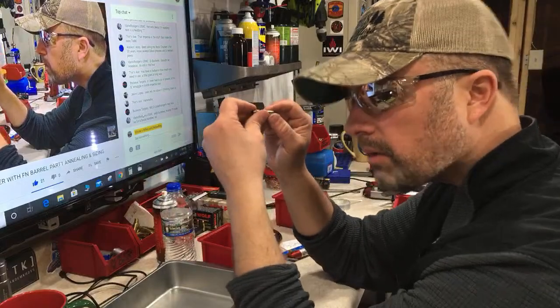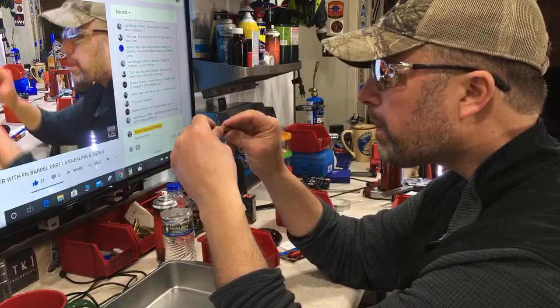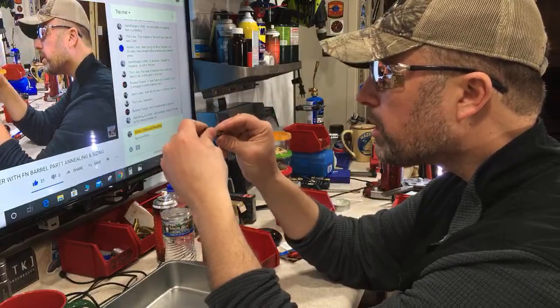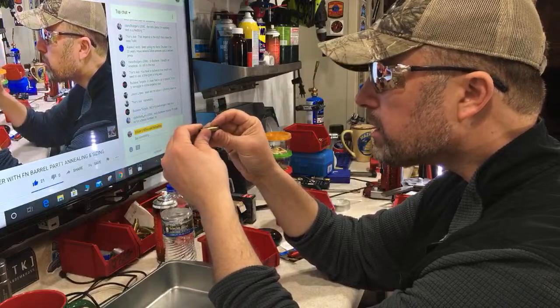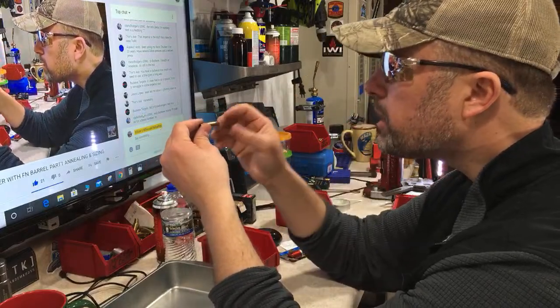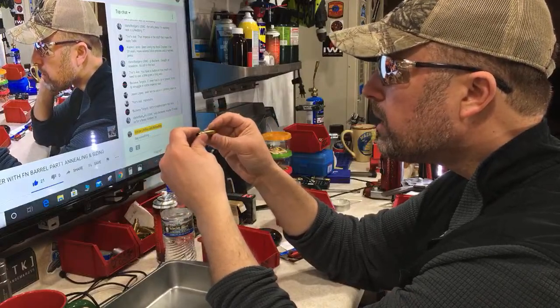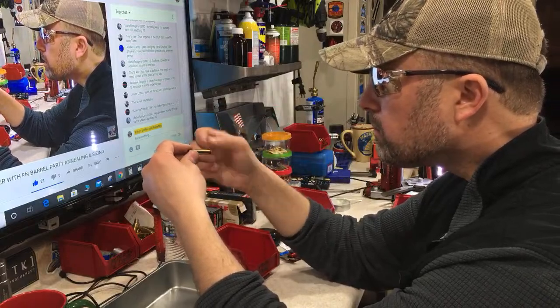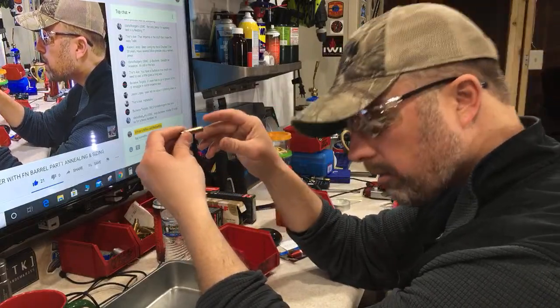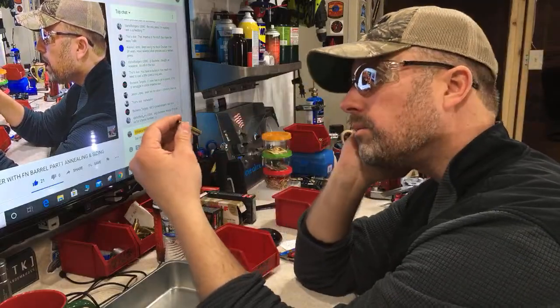And that's the luxury you get with the bolt action. You don't get that luxury with the semi-automatic, because with a semi-automatic, the bolt is pushed forward by a spring. You don't feel that tension. That's why you need the generous headspace bump of at least 3/1000ths to 5/1000ths of an inch. You're more concerned about function and making sure it doesn't jam. But with the bolt action, you feel that resistance through the bolt handle, and you can play around with that when you're trying to fine-tune your headspace for that particular firearm.